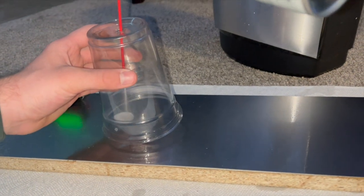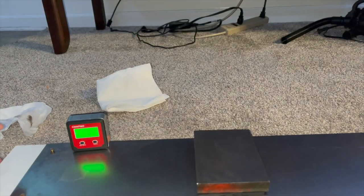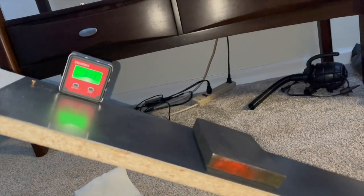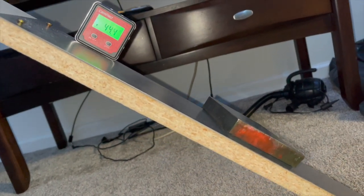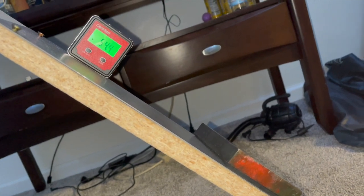The friction testing consisted of a steel sheet to replicate the bearing housing attached to a backer for more support. The rubber was glued onto a steel block and then placed on the board, which was lifted at an angle until the rubber slid on the steel. From there, a simple calculation would tell us the friction coefficient and thus the assembly force required. This process was repeated with and without lubrication.